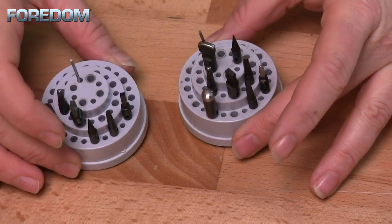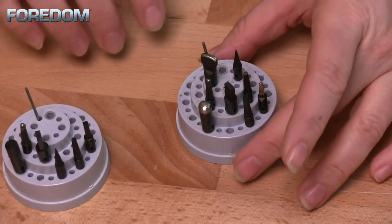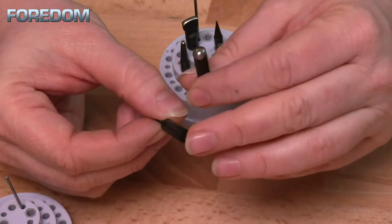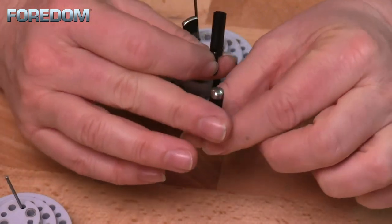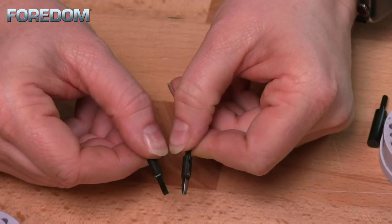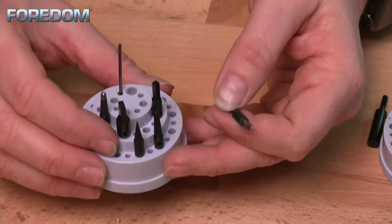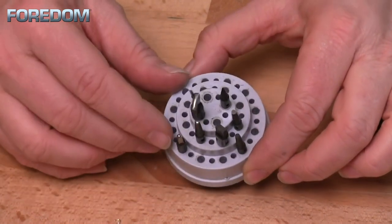When you get your hammer handpiece, it is going to come with one anvil point. I have two sets here that are nearly identical. You'll notice that some of these look a little bit different. Here is my round top one, or my cylinder — notice that this one is black, it's flat, and there's no shape to it. This is a blank. This is what I have done with that blank: I've shaped it and put kind of a semi-polish on it, taking these to about a 400 grit finish. This little one started out as a square, and I've gone through and reshaped it. When you get these anvil points, they are blanks, ready for you to alter them to whatever you need. Don't be afraid to do that. I have a couple of videos showing how to do the altering, and I'll link those at the top as well as in the description.